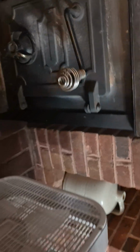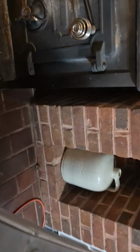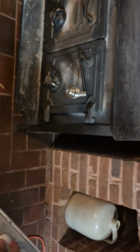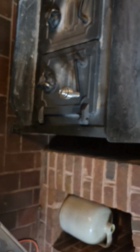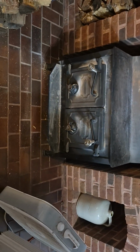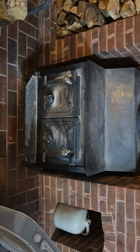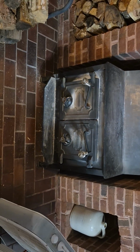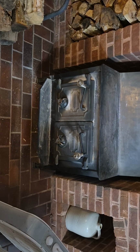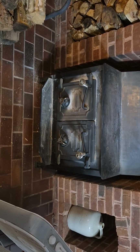And when that wood gets going in there, you will find in the hallway a box fan. It's a simple box fan. If you'll set it up, aim it at the side of the wood stove like that, and then turn it on to the high speed, it will start blowing air at that stove, and that will take the cool air off the floor and blow it around the bottom of the stove. And if you want to run it at 85 degrees in here, that stove is capable of doing that and heating the whole downstairs. Just be careful with it.